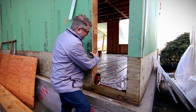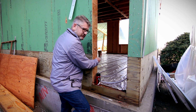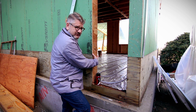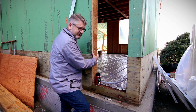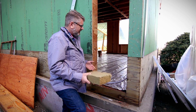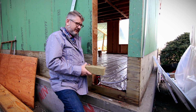So in assembly, here's our wall section. We've got a 2x6 stud member here. There'll be drywall and plaster to the inside. This 5.5-inch space will be filled with dense pack cellulose — recycled paper. This building is framed with advanced framing, 24 inches on center, so we've minimized the framing factor in the wall.